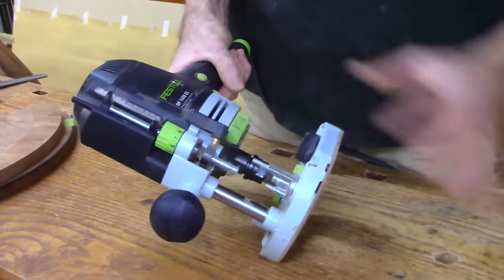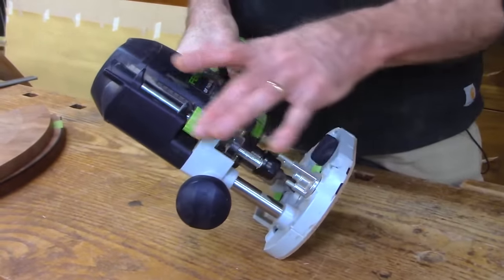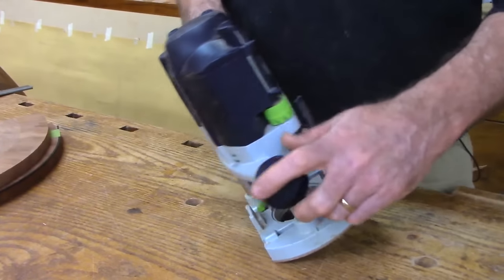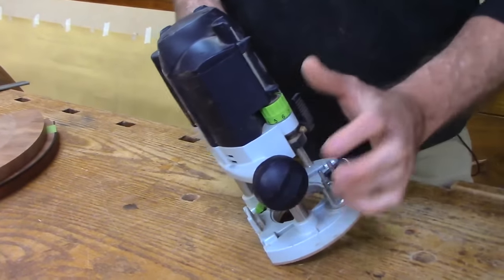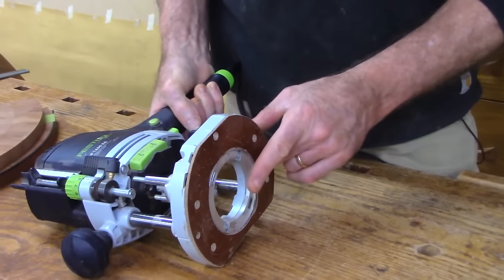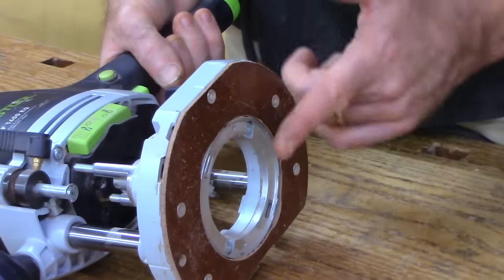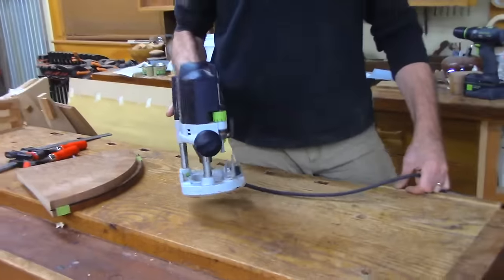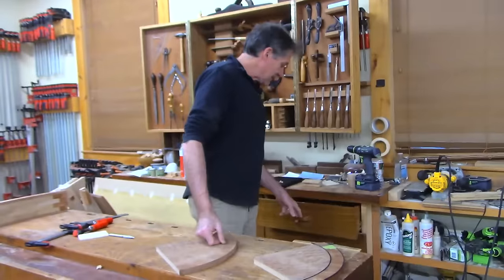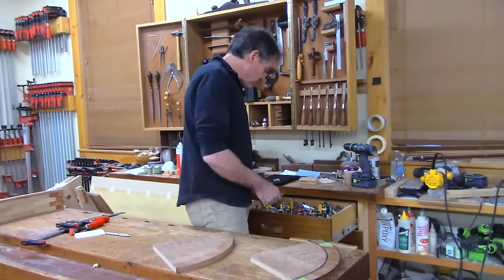Now, the fixed router, you're usually going to find a cylinder with a casing over it, and you have to turn it off, manually adjust it, set the depth, and then the router bit is proud of the base by whatever it is. You don't plunge it while it's in action. You're stuck with that, and it's usually just for cutting edge details, not for making a center cut. Typically, most edge details are cut using a profile router bit.